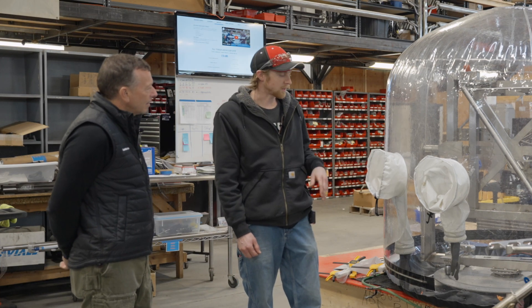Even before Gabriel gets it, we also had to build a supply chain for the right titanium that we needed to build this gear, making sure we're getting it from manufacturers that could vouch for the alloy we're using — its provenance and where the materials came from. We had to build that supply chain and then even prove out that the supply chain was actually working, to make sure we were getting the grade of titanium we expected to get. So all of that had to happen as a baseline to even start building this gear.